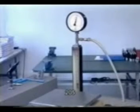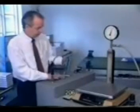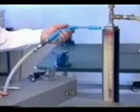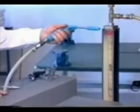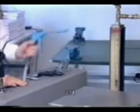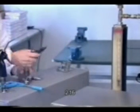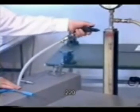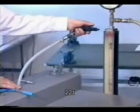The last factor we measure is air consumption. As usual, we start with the competitors. Please note that for demonstration purposes, we only use a relative measurement. The flow meter reading for the first unit is 46. We have a problem with the second unit. Our test apparatus is only capable of measuring up to 100. And in this case, our flow meter hit the roof, so it's more than 100. The third unit shows a measurement of 70.